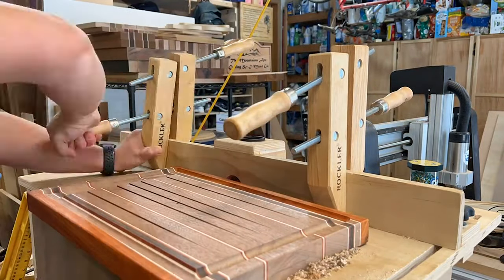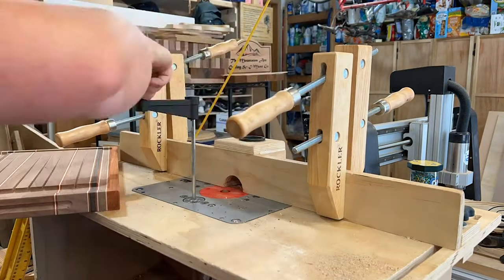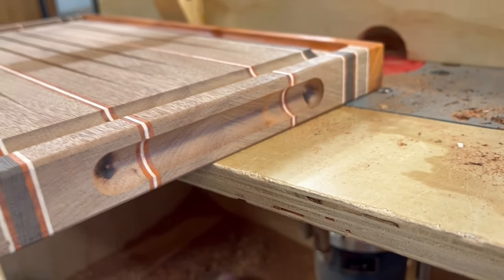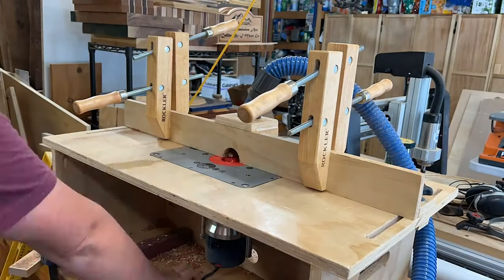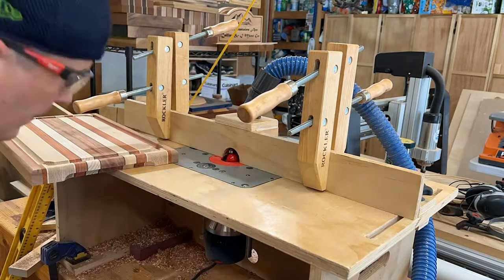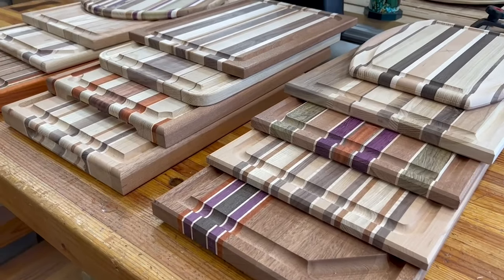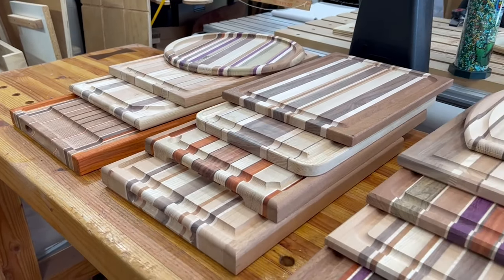Hand holds are a nice addition — you can use both sides of the board. This one uses a ball nose bit. I have a whole video on cutting board handles. On this one you can see some burn marks — I'll show a trick for cleaning those up shortly. One style uses a cove bit to get a little inset handle. It's a fun addition that elevates the board. Here are what the boards look like after all their CNC work with unique juice grooves and round-overs.